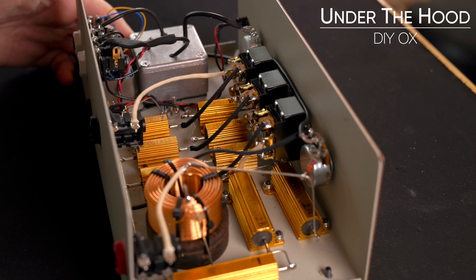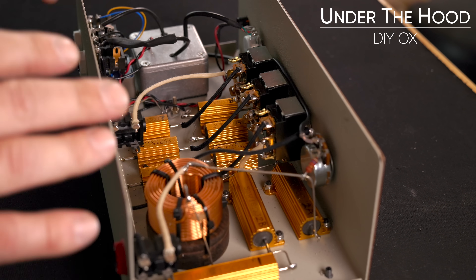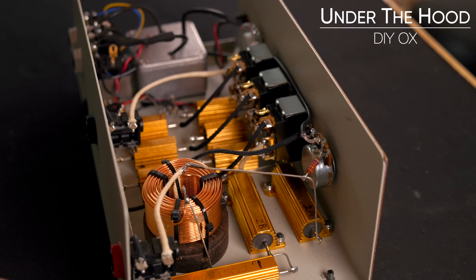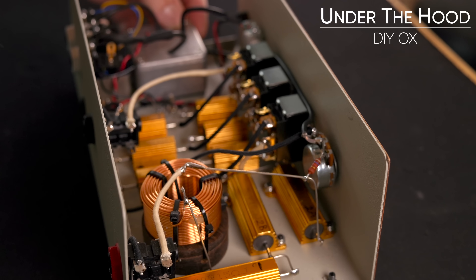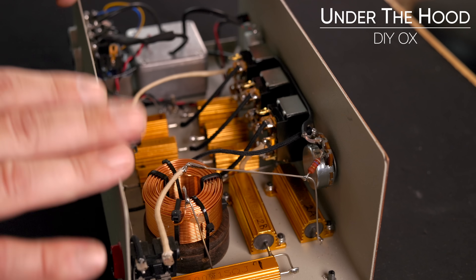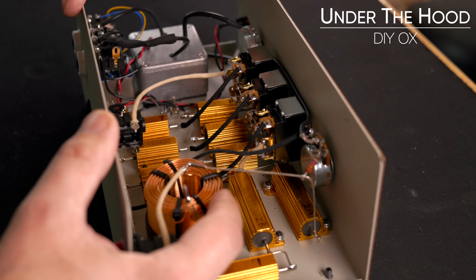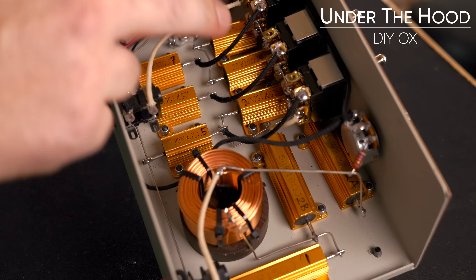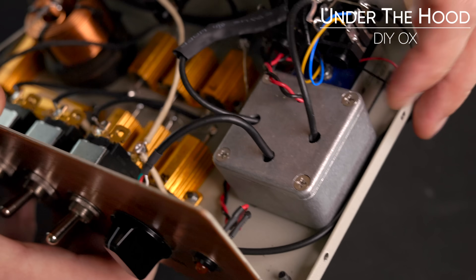The first thing I really want to let you guys know is this might look like a lot of work and it's definitely time consuming, but the idea is extremely simple. It's just a coil, some resistors, a few switches, there's a pot there. The trickiest part is probably this little box down here — putting in a speaker simulator — but you don't actually need a speaker simulator; you could just literally have a great attenuator with everything else. I urge people to give this a go, don't get intimidated, once you get into it you kind of realise how easy it is. That's my air coil there, here's the resistors — 100-watt resistor down here, 25-watt ones, my 50-watt one over here — that's my speaker simulator there, and that's my transformer underneath giving me that balanced line out.